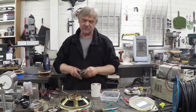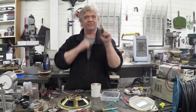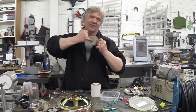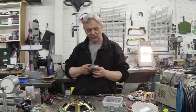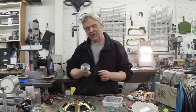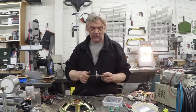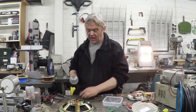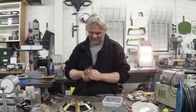And you have a disc like that. And on the other side, you have a disc with this great big lump of metal. But more importantly, it's got a dimple right there in the centre. I've drilled it out with an 8mm drill bit and stuck a bit of 8mm bar down there, and it's a nice tight fit. I did stick this in the lathe to turn it, but it was pretty true actually — it doesn't take much turning at all. So if you don't have a lathe, just drilling it and whacking a bit of 8mm bar will do it.